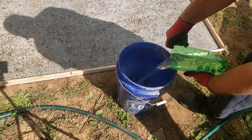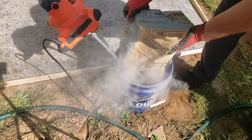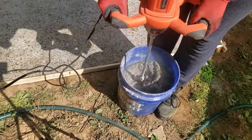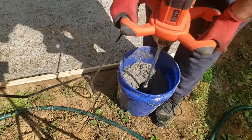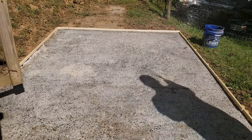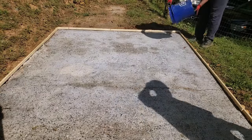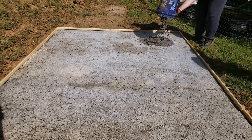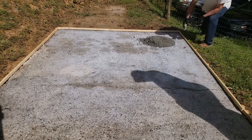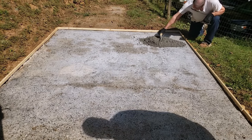I'm using a bucket and a mixer to pour the concrete, though you could simply use a wheelbarrow or a hoe. I find it mixes a lot quicker if you put the water in first before the concrete mix. Before pouring, I'm slightly dampening the old concrete surface to help prevent the new concrete from drying out too quickly. My dad was able to help me out with this project, which I really appreciated as I was dealing with a cold. You could do this job by yourself, but if you have a friend or relative willing to help for an hour or so, I'd strongly encourage it.